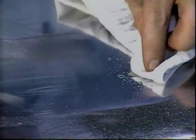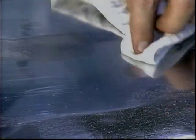In the case of a weld repair area, many weld rods will not turn copper color due to the alloy mix involved. Checking the perimeter of a finished weld repair with copper sulfate will indicate any extra chrome loss beyond the repaired area.